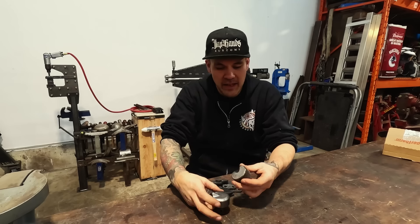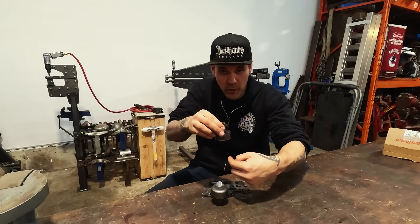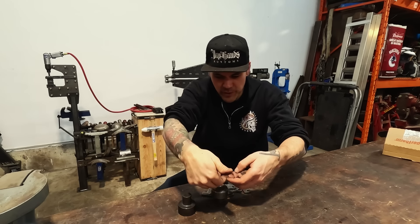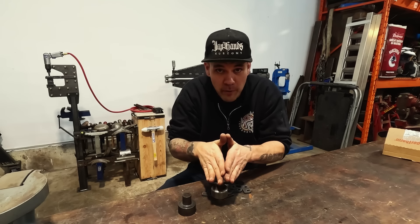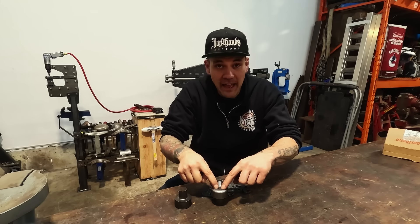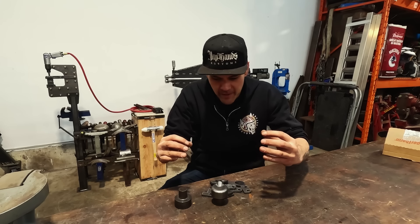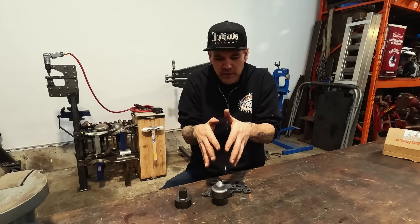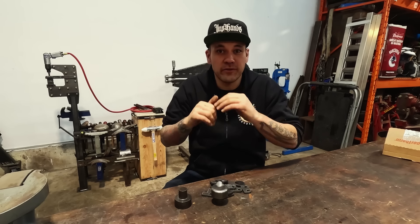As these dies are being forced together, the sheet metal goes into that and comes into a big wrinkle. As that sheet metal gets pulled out, the die is forcing the sheet metal back flat while that wrinkle still exists in the material. So it's creating a point where the material actually gets pushed thicker because there's all this material collected up here and that's hammering it flat — literally pushing the material together to make it thicker.